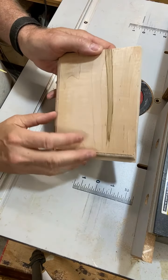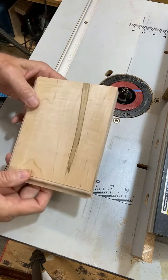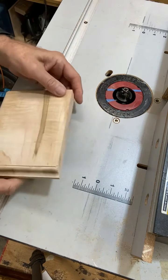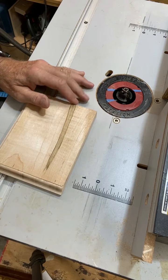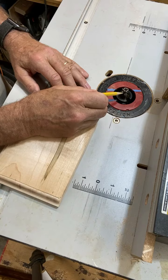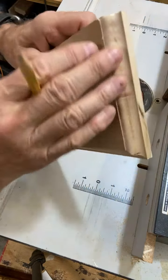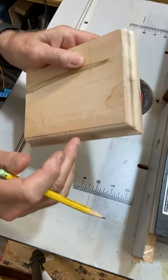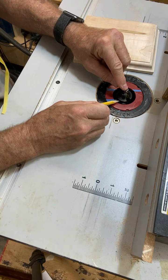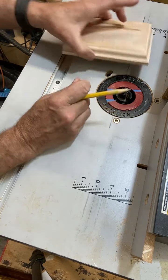Now I'll make a base for the nameplate. I found some scrap soft maple in the shop, so I decided to go with that. Also, I want to round over the edges of the board. I decided to go with a classical form Ogee router bit. It's a 1/4 inch shank with a 1/2 inch forming. I made a few test runs on this to get the edges just the way I like it, and I raise the router bit so it's just barely above the level of the router table.